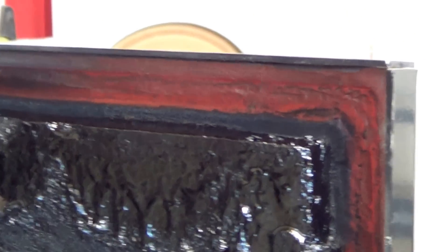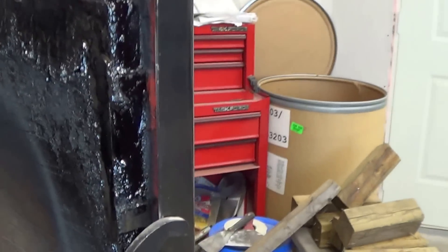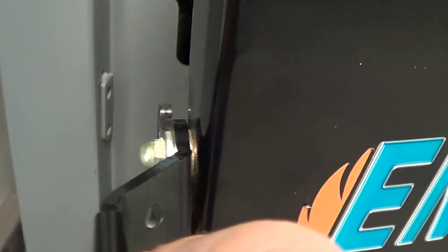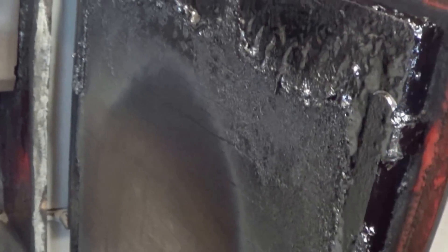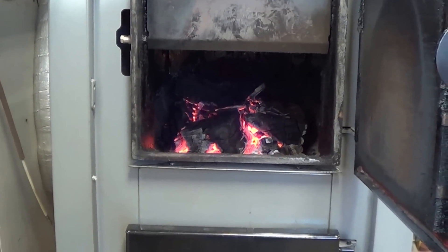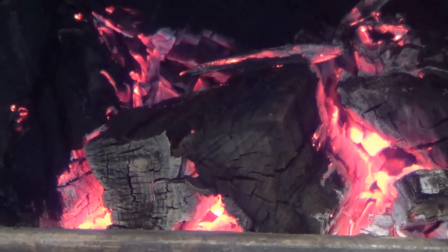You can see there's a fair amount of creosote that builds up — you can see it on the door. That was one of the reasons that in version two models we went to the cam lock latch, where everything latches from the outside. The original version had a lever that locked on the inside and it could get built up with creosote. This creosote will burn off when we're at the tail end of the burn cycle where it's looking for moisture.